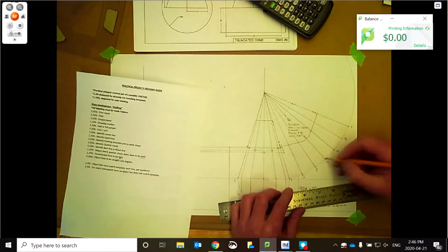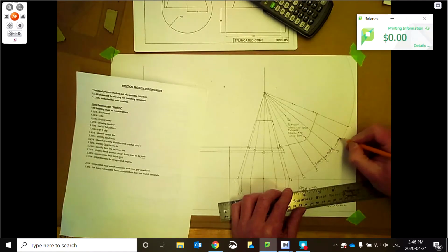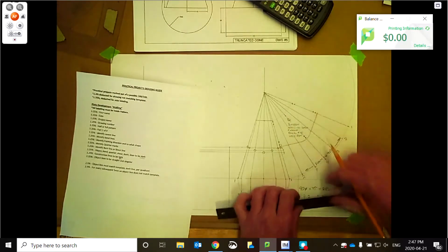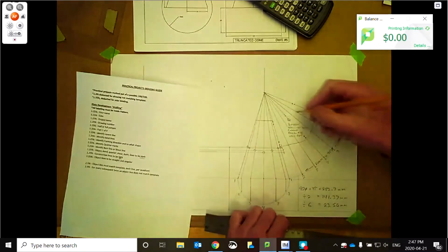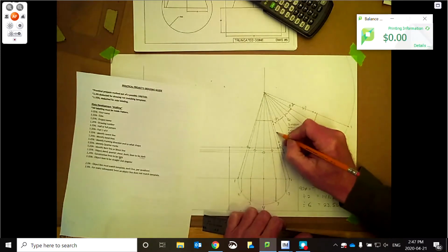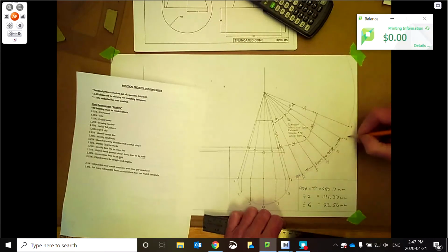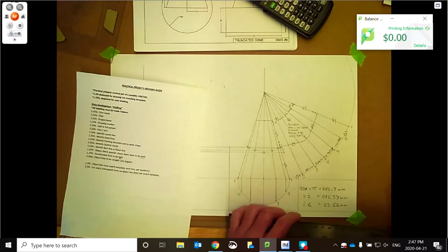So, but for this one here, for this example, I'm just going to put form to 90 diameter, and we'll leave it full size until we form it, and then we'll cut it. Up top here, I didn't have a dimension, but we will measure for that. So it looks like it's about 30. So we will form to 30. That's along here, and that would be cut. So that will be a burn line. These will be shear lines. This will eventually be a burn line, and this will be a burn line down here. That'll be a shear line, and you're shearing all the way through. Okay, and there's the pattern for that.